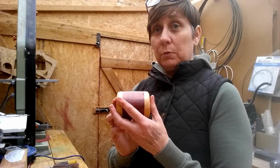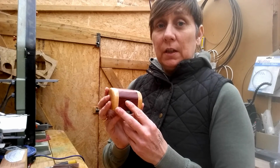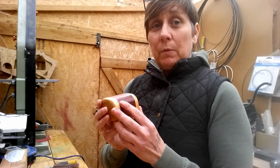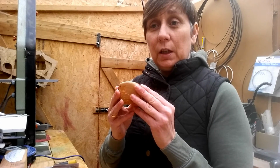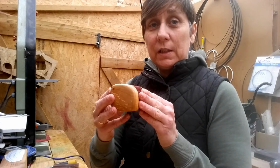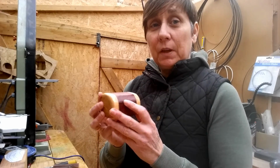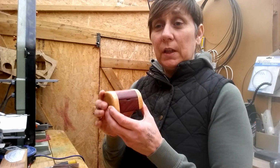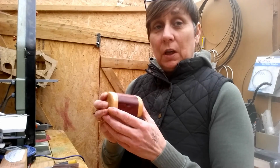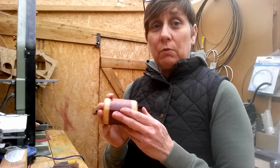It took me a long time, months and months of practicing to get it that tight. But see, once you get it, no problem. Once you learn about pushing the blade in from the front and using it to steer your way through the wood, you can virtually go around anything. I've done puzzle boxes, and it's like a jigsaw piece on it, and I've done that all on these old bandsaws with a 3mm blade.